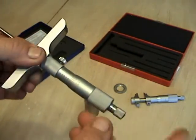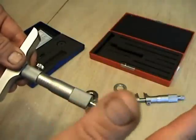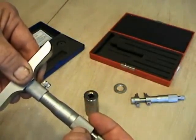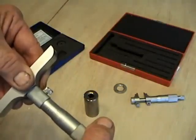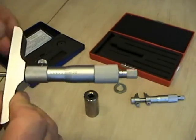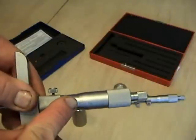Now to read this, it reads backwards — so be very, very careful. It looks like I'm getting about 518 and a half thousandths. The easiest way to read it: back it up to this point here — I see that I'm at 500 thousandths, then 505, 510, 515, and I was right at 518, maybe 518.5. And I do not want to forget to add my two inches. So the answer for this socket length is two inches and 518 thousandths.